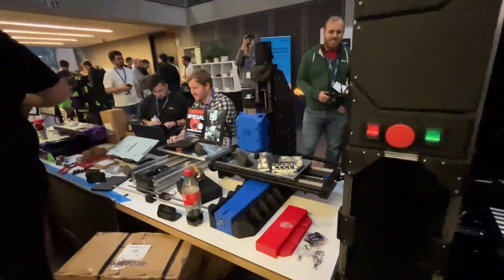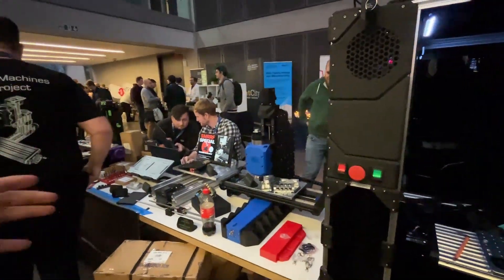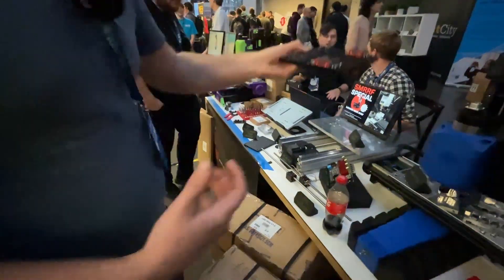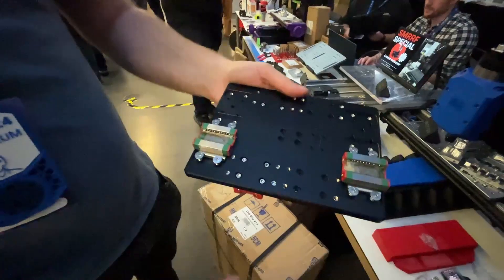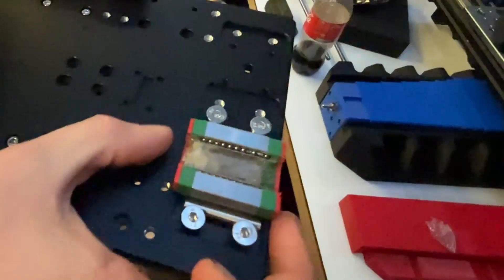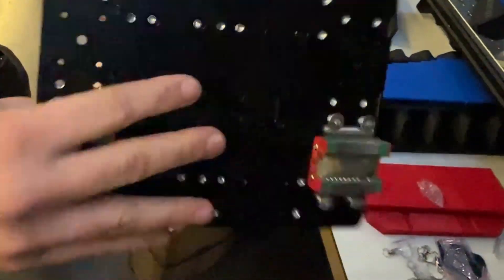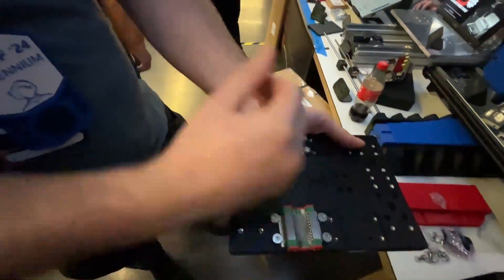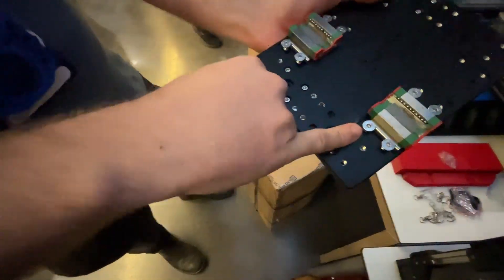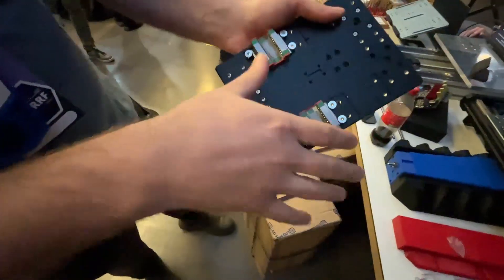There are loads of quality-of-life improvements in terms of the actual build this time. A lot of feedback we had on v1.5 was about perpendicularity of the X and Y axes — it was really hard to set up. In the XY plates we've actually designed features which allow some countersunk screws to press up against some dowels, which press the carriage into the exact position needed for each axis to be perpendicular. So as long as you get one rail on both sides and set it up like this, the perpendicularity will be close enough that you won't need to worry about it after the machine is assembled. These features do get removed after installing the carriages, but they get reused later in the design so you're never wasting any bolts.